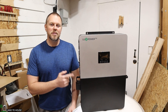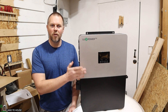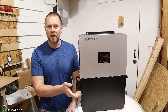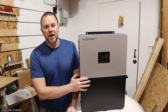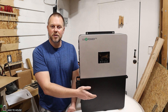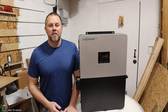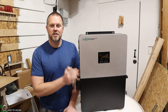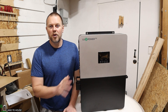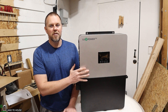This 6,000-watt inverter is split-phase, so you can either use one leg and the neutral with a ground for 120 volts at 3,000 watts, or use both sides of the load for 6,000 watts at 240-volt output. There is a surge power of two times the rated power, so if you're using one leg at 3,000 watts, you get 6,000 watts surge for up to five seconds — if you go above that it will trigger a shutdown. The inverter weighs 52 pounds, so make sure you have somebody helping you when you mount it on the wall. And lastly, this uses less than 60 watts for idle consumption, which is very nice to see on an inverter of this size.